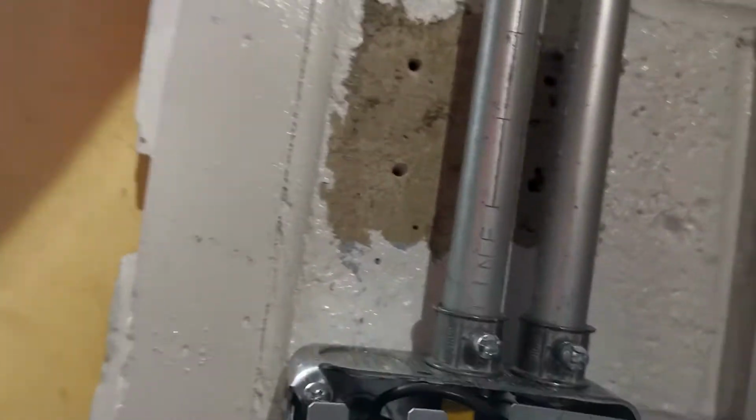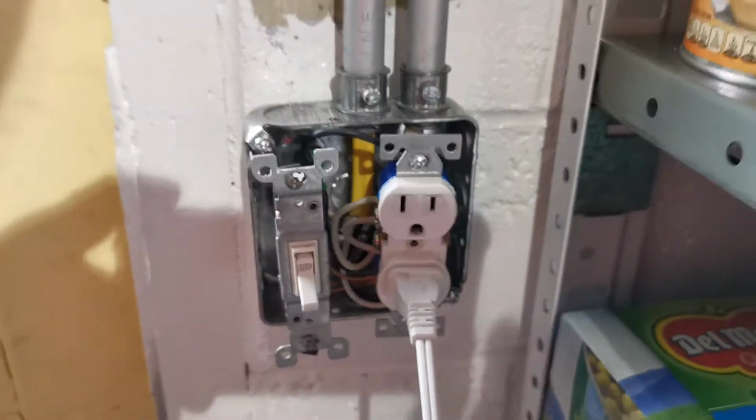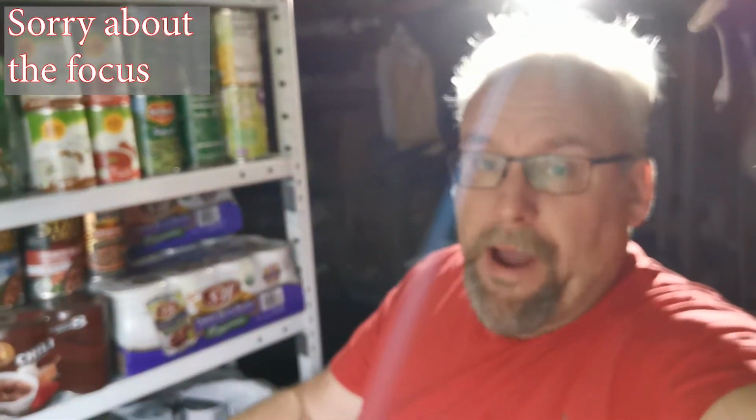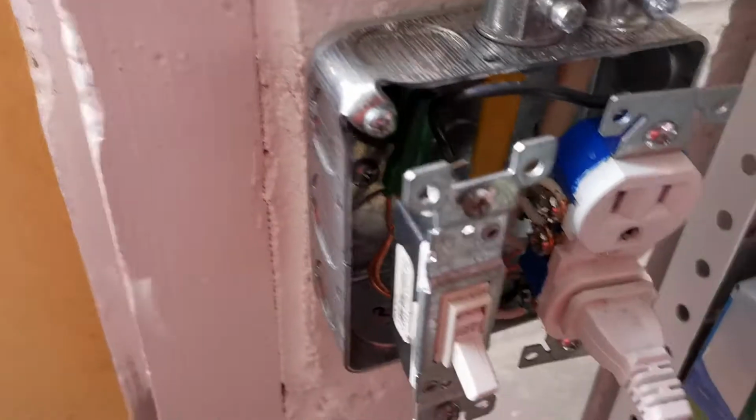If you switch the neutral and you carry the black one through, you're bringing your power straight through here and up to your lights. And what will happen is the power will come in to the switch and you're going out to both outlets up here in the ceiling. I don't know if you can see them or not. And if you ground yourself to the black side, you complete the circuit and get shocked. If you switch the black instead of the neutral like I had originally done, then you're killing the power at the switch itself. Now, so back to this outlet,